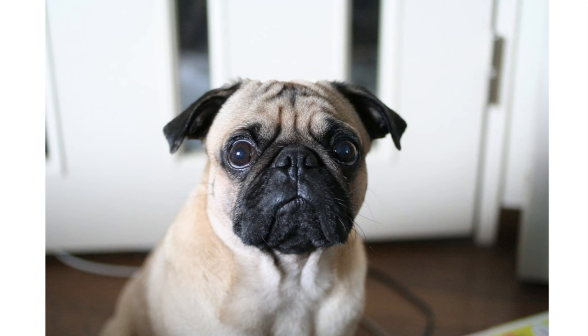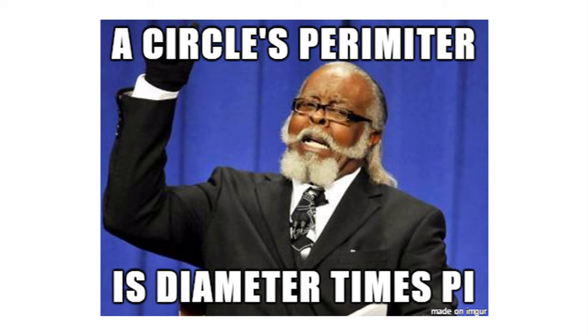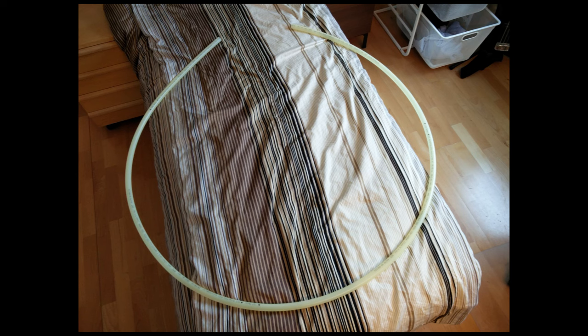Now you need to figure out where you will be doing your recording. Since you will be standing inside the booth's ring, you must be able to stand there without touching the blanket too much, as this will cause noise. Depending on your physical size, you are most likely widest over your shoulders. Pick up the folding ruler and do a measurement from shoulder to shoulder. Place yourself next to a wall, let the ruler hit the wall, get a bit of space between the wall and your shoulder, and measure the distance to your other shoulder including that same extra distance. From shoulder to shoulder I measure 70cm, but I need to breathe too, so I gave myself 15cm on each side — a total of 100cm. Now, back to math class: this is a circle and we need to find the perimeter. Simple formula: the diameter times pi.